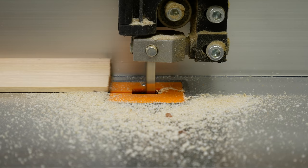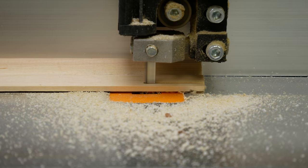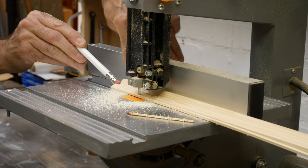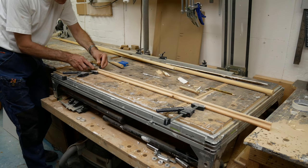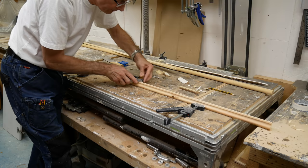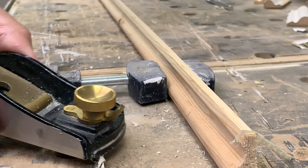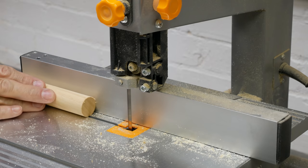I'll do the OG moulding first, and then we'll do the rest of it later. All right, that's come up pretty nicely. A couple of quick swipes with the hand plane just to clean that edge up. I'll probably knock that sharp edge off slightly with a little bit of sandpaper, just to age it a little bit. Otherwise I think that's fine. I'll fit the 6x1 Redwood baseboard to start with and just pin this on — I'm pretty sure that's how that was done originally — which will save the messing about scribing the two edges, just going to scribe the profile in. And then next up we've got to cut the dowel in half. We'll run a quick test on this to make sure we've got it halfway through.